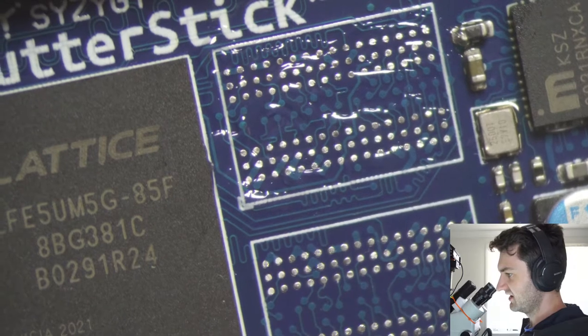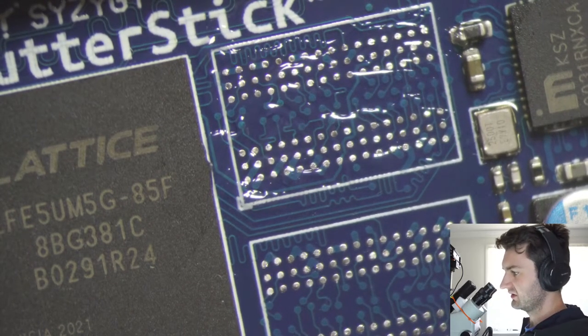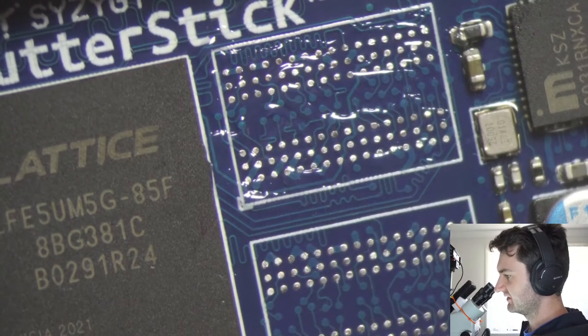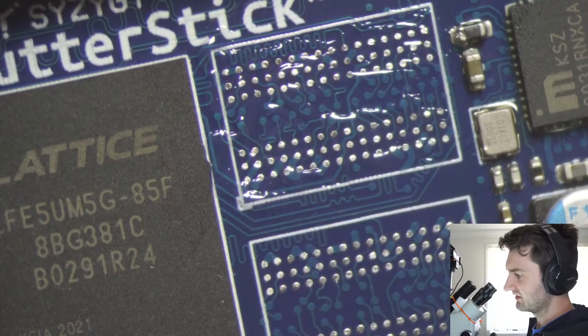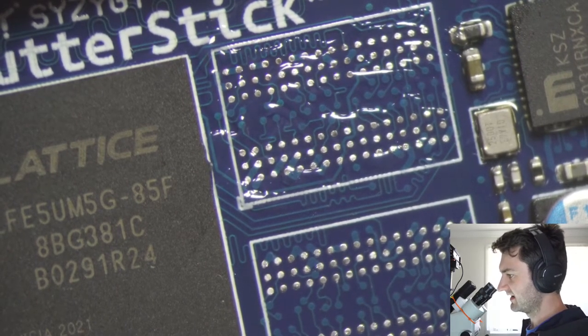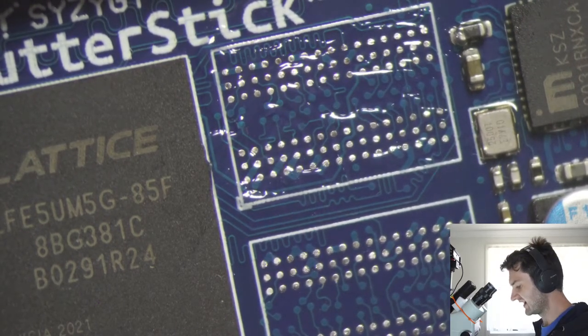So I'll turn down the airflow a little bit because we don't want to... Airflow helps transfer the heat from the heat gun to the circuit board, but we don't want to basically fling the parts off. So it's a bit of a trade-off, because you're reducing the amount of thermal energy you can transfer into the part if you reduce the airflow. But it means the parts won't fly away, right? They're not going to turn into a kite.